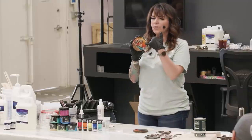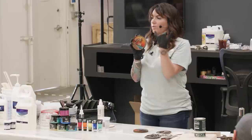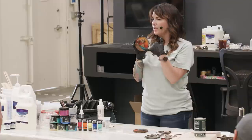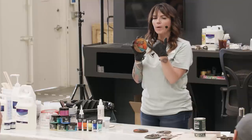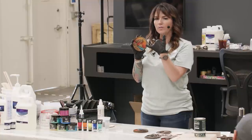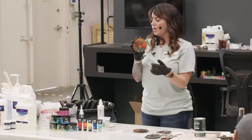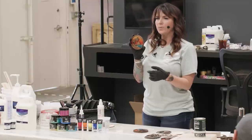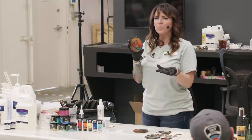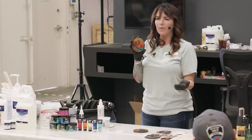In this one you can see it shrunk down a little bit. If that happens, you can either sand it down on a large piece, or put a little more epoxy on top using a syringe to control the amount. Put a little on, let it sit and spread out, then see if you need more. We often get excited and forget epoxy is going to flatten out like warm honey — we add too much and it's everywhere.